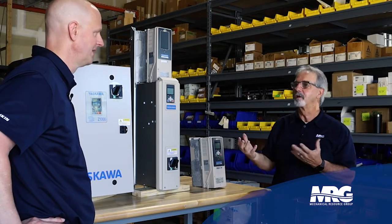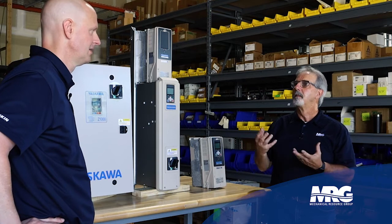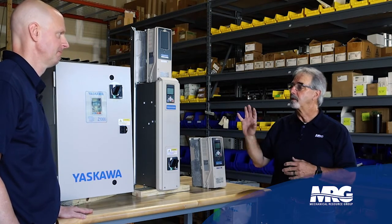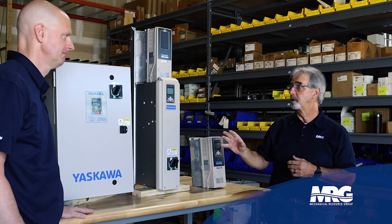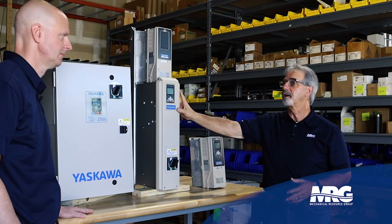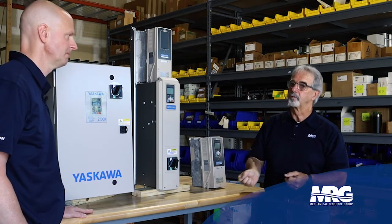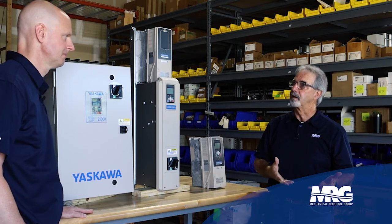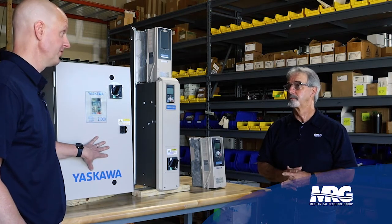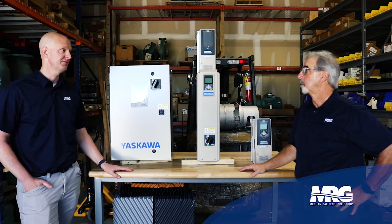You might ask why we go to such great lengths. Every device has a meantime between failure rate. Yaskawa's MTBF rating is 28 years. In order to get even close to that, we have to be aware of the environment we apply the drive into. If we put a drive into a very dusty enclosure, particulate fills the drive and sticks — it's like wrapping your TV in a blanket and turning it on. You might not notice for the first five years, but post that you may only get 10 years out of it — only half or a third of the life expectancy.